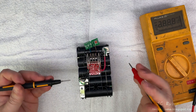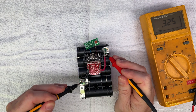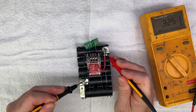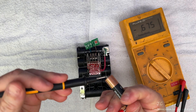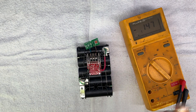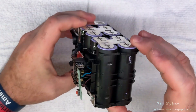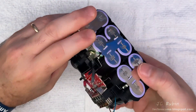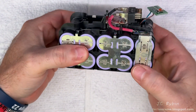I'm going to measure across the positive and negative terminals — yeah, I got nothing. Battery is completely dead. I'll check my meter against a double-A just to be absolutely sure, and it's working properly. Because of the way it's welded in groups of four, four, and two, it's going to be impossible to identify if there's one or more bad batteries unless one side is completely disconnected.